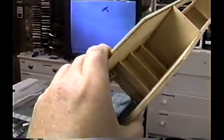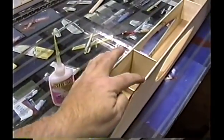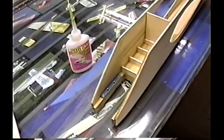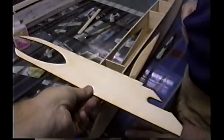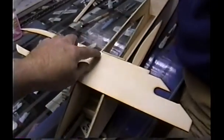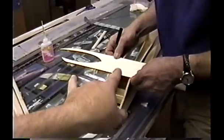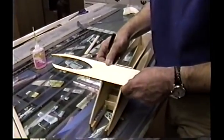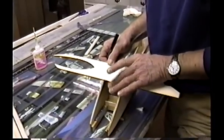Nice. Okay, now use an 1/8 inch light ply and get a real accurate tank floor. Make sure all the corners and edges and angles are 90 on that. With the light ply, we want the grain going side to side. But make sure, put your mark on there. Make sure every corner is 90 degrees. This will go right in. We just happen to have 150 of these doublers that were cut out of light ply by our co-partners at SIG instead of cutting them out of plywood. I think this is wide enough.